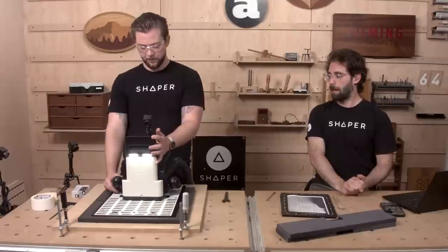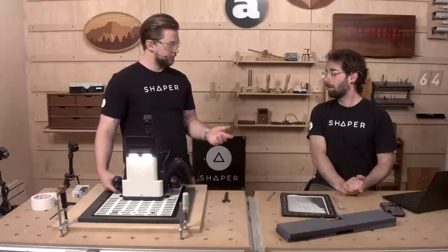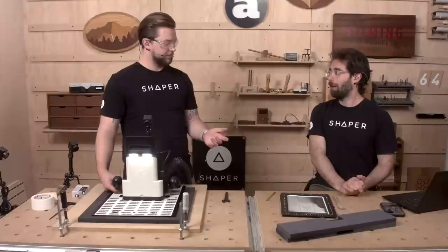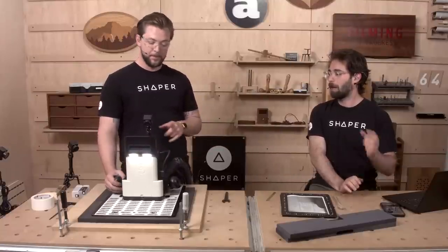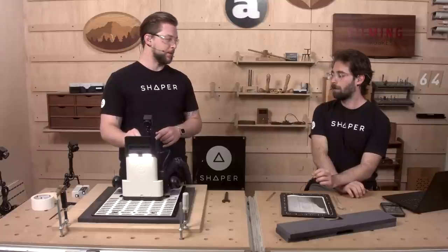Okay. All right, back to roughing. Should I try to rough it with this bit? To show the people what it's like? Sure. Okay. Are you going to do it all in one depth, or are you going to do it in two depths? I'm going to do it in two depths. So you got to still use that 6 millimeter offset. And that looks like 6 millimeters to me.